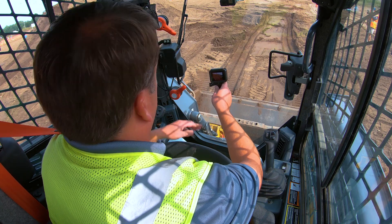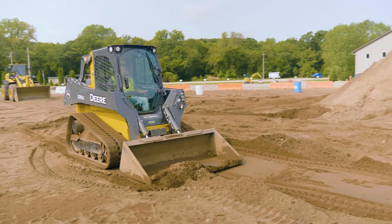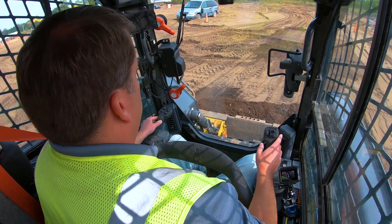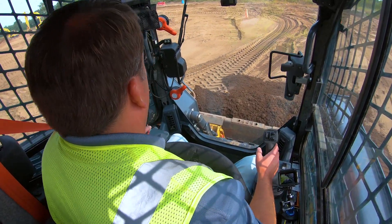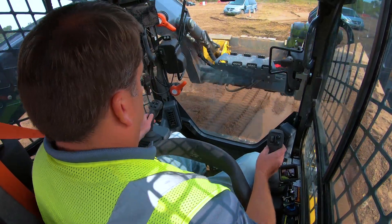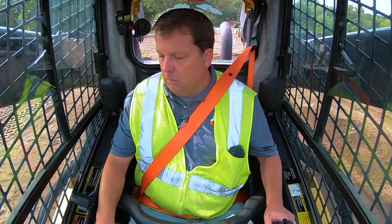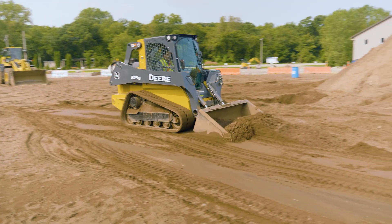It's very similar to using a dozer if you've ever used one. So now I'm going to drop this all the way down, flatten that blade. This time I'm going to go over just a little bit because I see there's a lot of material over here. I'm going to fill that bucket right there - I'm just driving it through. Then again backing up, knowing there's a low spot back here. So I can feel it. Assessing what I filled in there - these are just quick and repetitive passes, going back and forth, flattening that bucket.